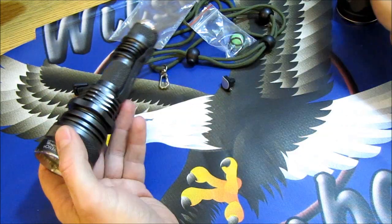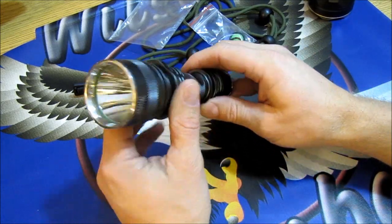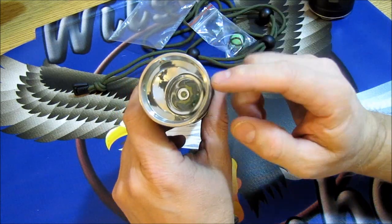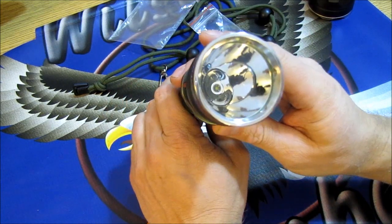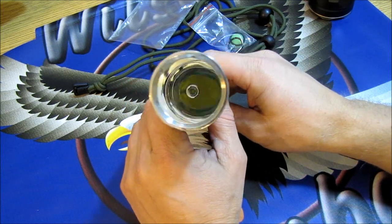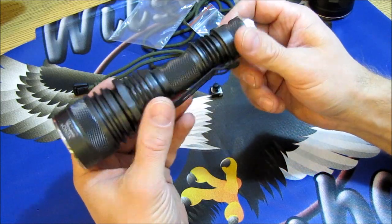So that's really cool for me after carrying this for so long. Nice to be able to shine this and really light something up with some nice lumens while still having a lot of throw. Now a lot of people know, Candle Power Forum people will know, we can go up to SST 50s or XMLs and make a lot more light, but they're not going to throw. So if you want to throw a lot of light, there's a little bit of trade-off. You're going to have to sacrifice a few lumens. That's not to say that these other awesome LEDs aren't very good throwers in their own right, but this is going to typically outdo those a little bit. That 22,000 lux reading was on my cheap DX light meter, so I'll try to get some more accurate results for you here in the future.